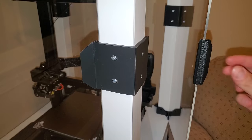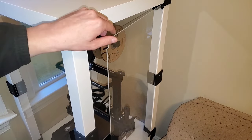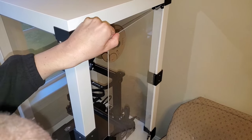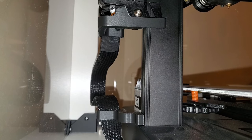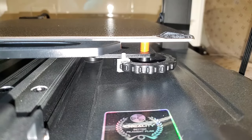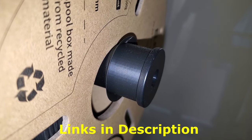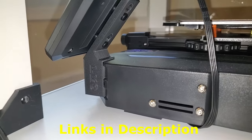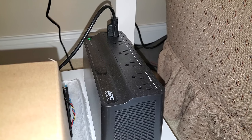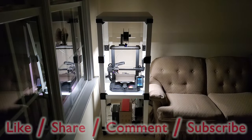I designed and printed some handles which line up nicely with the coupler. The plexiglass added a good bit of weight, so it's nice that the doors can be easily removed if I need to lift off the top. The hinge design is plenty strong to support the acrylic, and reattaching the door is just as simple. To hold the printhead ribbon cable parallel with the printer, I designed a pair of clips based on pieces from designs I found online. Some other handy mods I printed from Thingiverse include bed locks, a scraper holder, a spool spacer, and a mount that shifts the display forward at a better angle. I also added a UPS down below to prevent failed prints due to momentary power outages. This was a great project to introduce me to the world of 3D printing and design. Feel free to rate this video, add your comments and questions below, and subscribe for more.